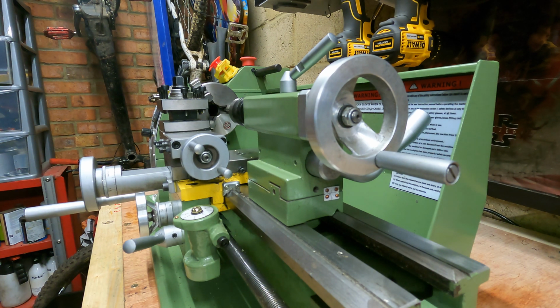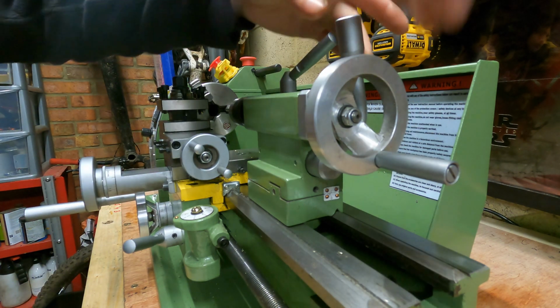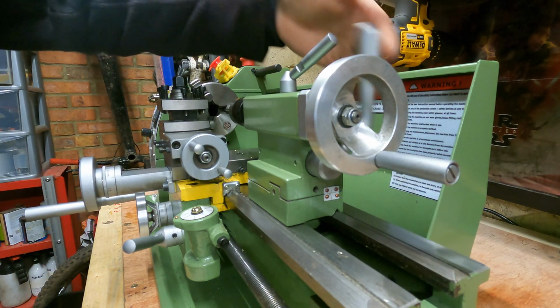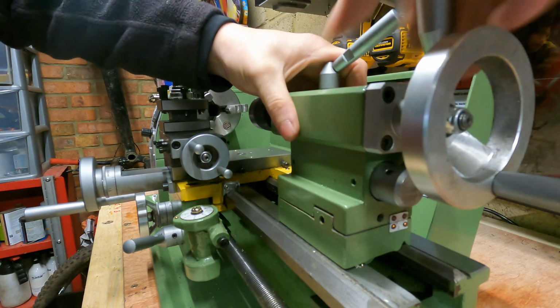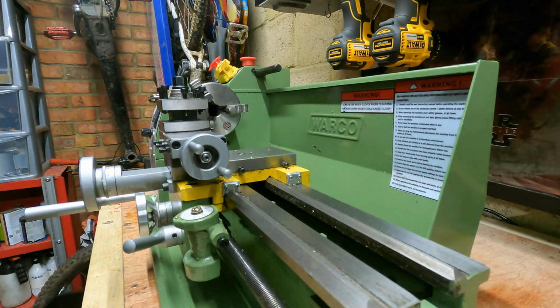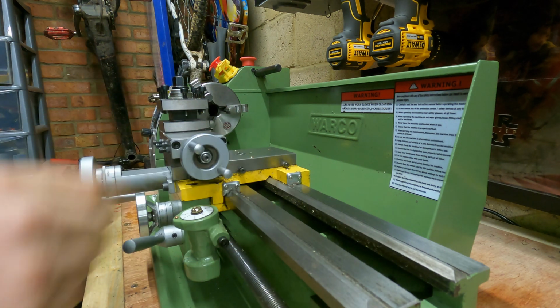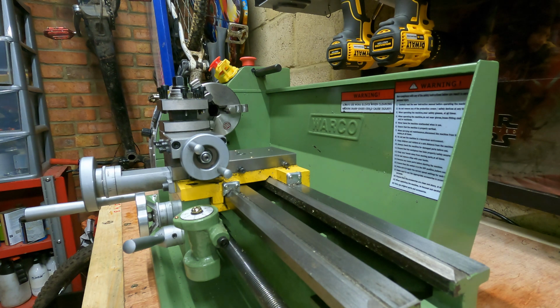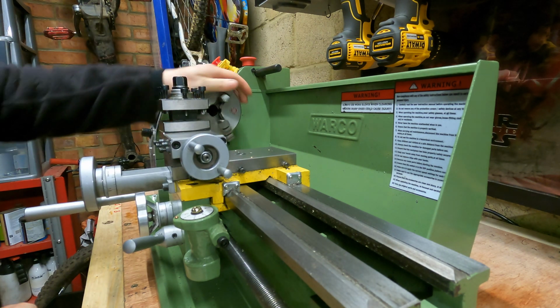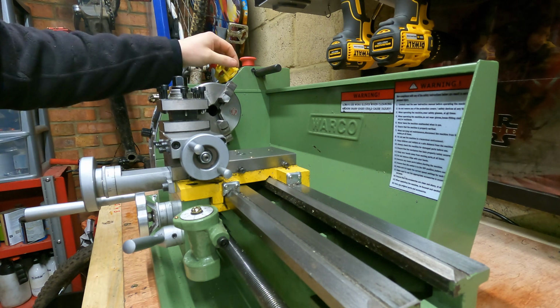So after you've hit that subscribe button, I would personally start off with taking your tailstock off. So literally just unlock it, and I've already taken the bolt out of mine, so mine just slides straight off. So with the tailstock out the way, everything is a bit easier to get to. Make sure you've disconnected the back power, because you're going to have your hand quite close to the chuck. You don't want that for some reason just coming on.